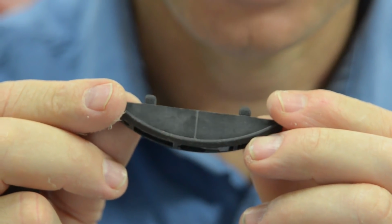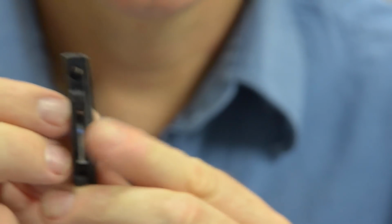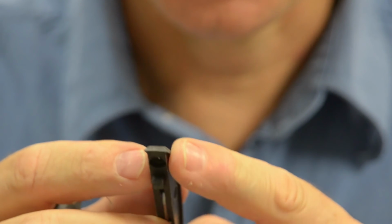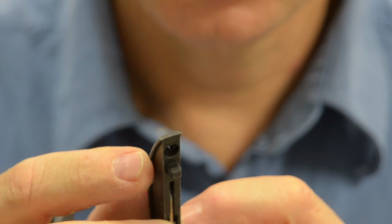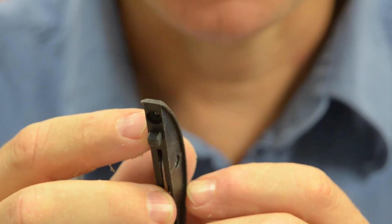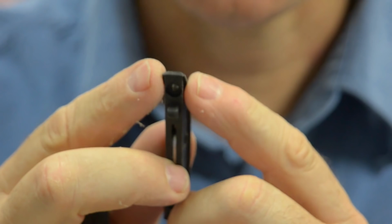They're quite an involved part. Quite a beautifully engineered little product. Now the trick that this machine has, now that shows it pretty well, there's this sort of a keyway that grips inside the cut. Now of course that's a bit of a tricky cut to make, and that's what the Lamello Zeta P2 is all about, is making the cut that will accommodate this keyway, so as to give this some purchase on the material. Okay, that's the Clamex.